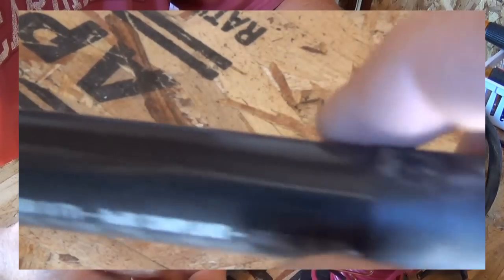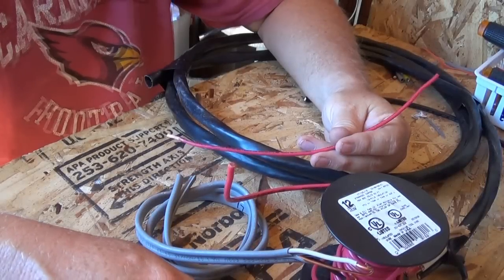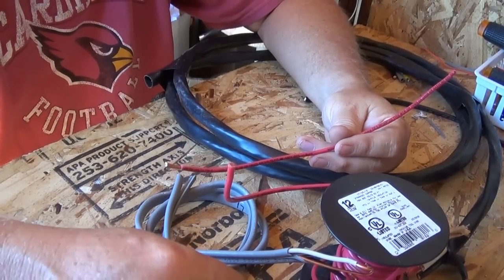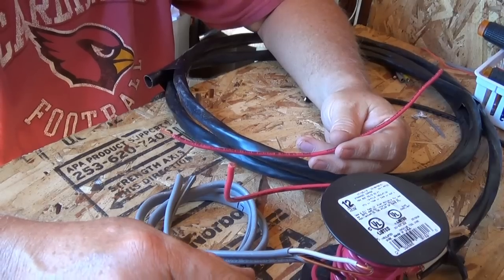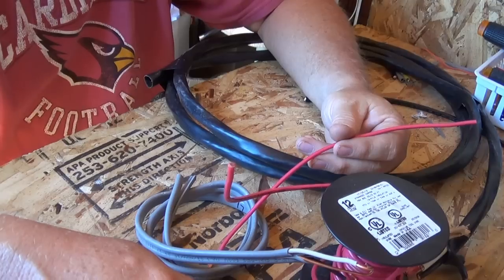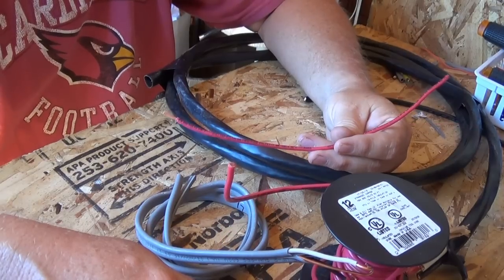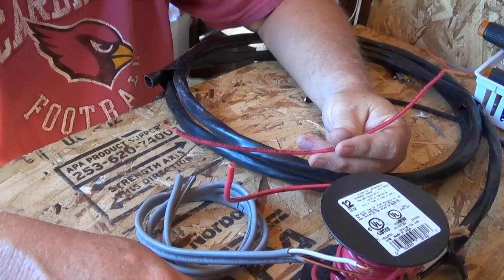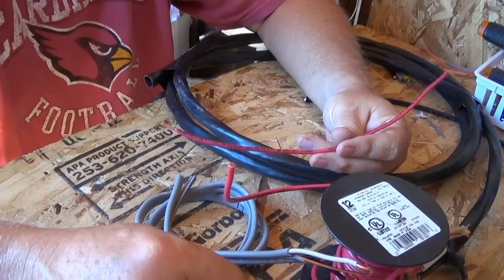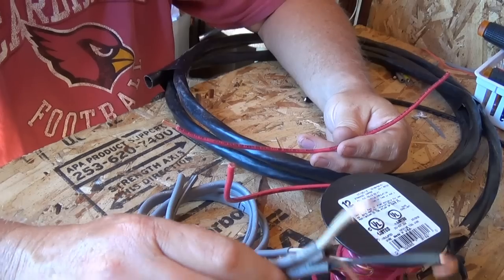You want that heavier wire because not only do you want no loss between each battery connection and from your batteries to your inverter, but you also need to handle the amperage you're going to draw. The volts you're not too concerned about, because you're not going to have 300 volts on your battery system. That's why size matters. I've seen people use car battery cables — those are not rated for the proper amps and you will melt that insulation, burn yourself, or cause a fire.